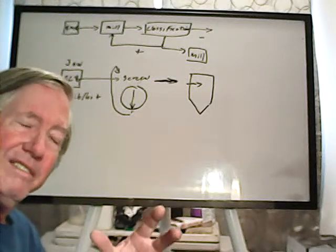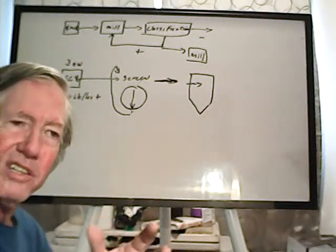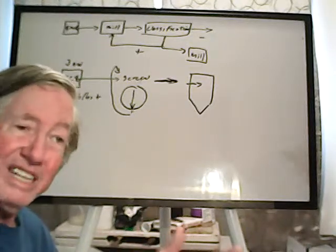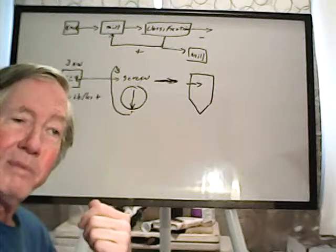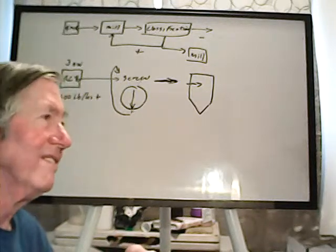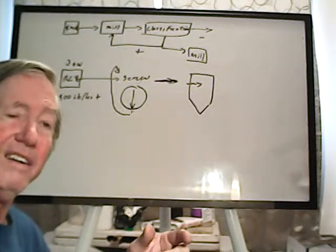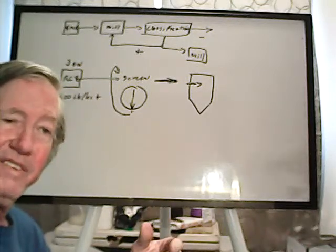There's a lot of different chemical systems that will separate gold and silver. It's just the simplicity of the nitric acid and precipitation thing. Almost anyone can do it. You look at the complexity I'm running into here. That's because I want something that's simple, safe, cheap. Well, you're looking at every possible solution as well as what is the best for your ore. Well, it's a process that you'll go through with any ore. You're going to go through this similar process. Yeah. To find liberation and to find where you can get your mineral out, and then taking your mineral to a brick or a block or an ounce or whatever.